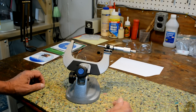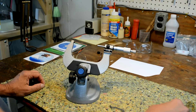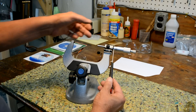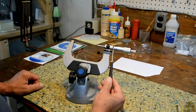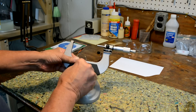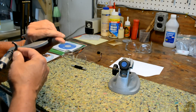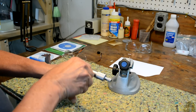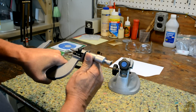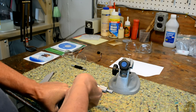What we're going to do here is turn this barrel clockwise. The reason for that is, see this little black part here? If I turn it counterclockwise, this is going to come apart from the frame and I don't want that to happen. I don't need more work for myself. So I'm going to bring the datum line in line — right about there.